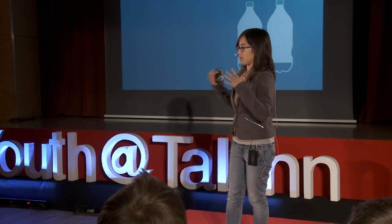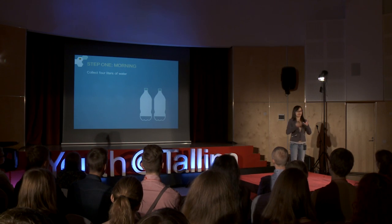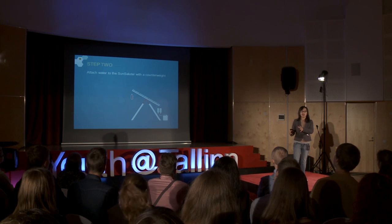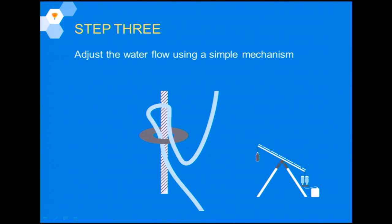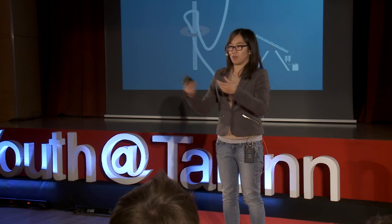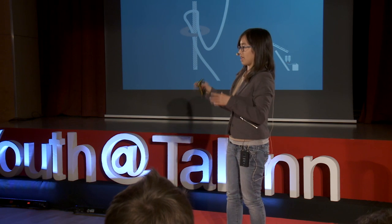The Sun Saluter works by using pop bottles that store the water. I chose pop bottles because they can be found anywhere in the world. You fill these pop bottles at the beginning of the day with the water you've collected. You attach the water to one side of the solar panel and then have a counterweight on the other side, so the solar panel is on a swing. The east side will be heavier, where the water clock is mounted. You then calibrate the water flow so it drips out at a very steady rate by changing the height of the system — when you change the height, the amount of water that comes out also changes — and using a machined metal block, I can control that flow rate so it remains the same throughout the entire day.